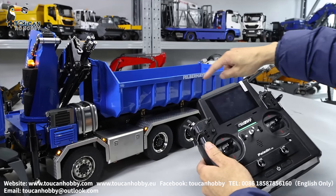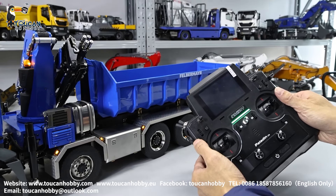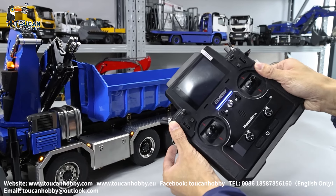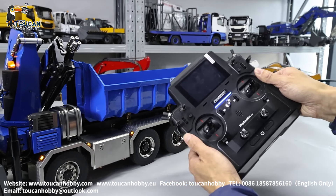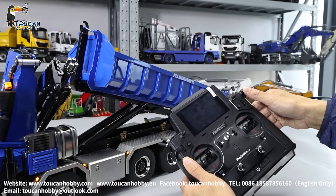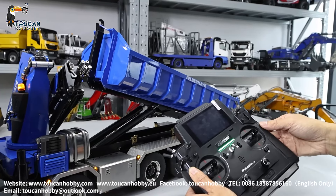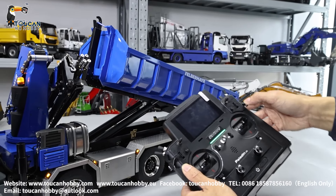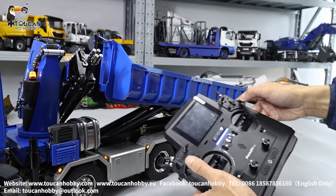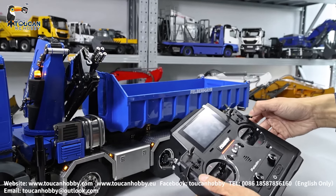For dumping and roll-off the bucket, use VRD and VRE. First make sure it's sliding — VRD sliding to the front to lock the arm for dumping. Now dumping by VRE, rising. It can rise all the way, like 50 degrees. Drop it down. During dumping, do not slide to the rear side — if you slide in to the rear side, the arm will drop, will bend, the bucket will drop and be damaged.